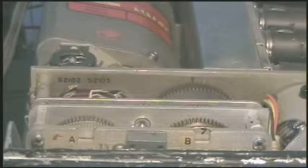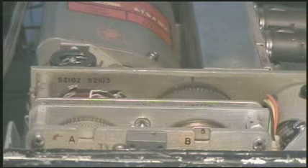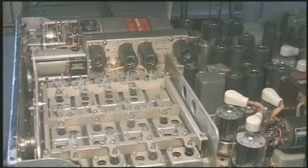After a channel is entered by the control head, the SMO has a series of gears, clusters, and cams that set the SMO on channel. Once channeling is complete, the variable IF and RF deck will then tune itself, and the receiver and exciter will be set on channel.